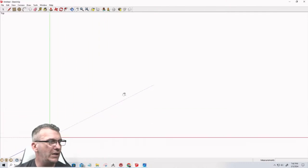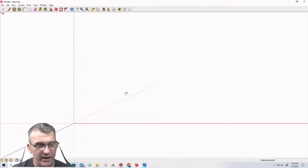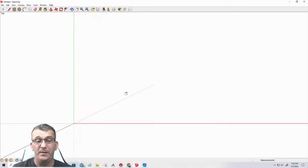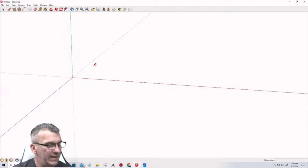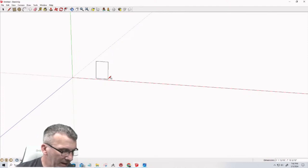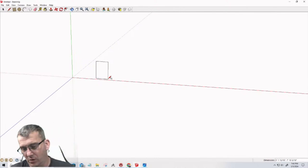Okay. So first off, I'm going to start off with creating kind of the midsection, and then I'll create the top and the bottom. The top and the bottom are exactly the same. So let's start off. Here, I'm going to tilt this around, and we're going to go with a rectangle that is 21 inches by 12 and 3 quarters. So I'm going to type 12.75 comma 21.